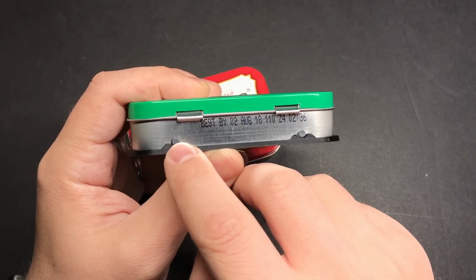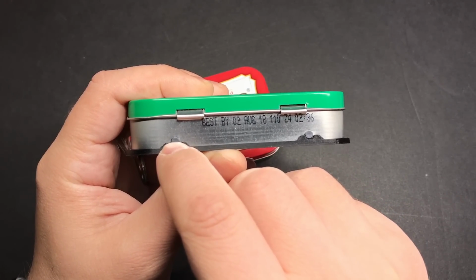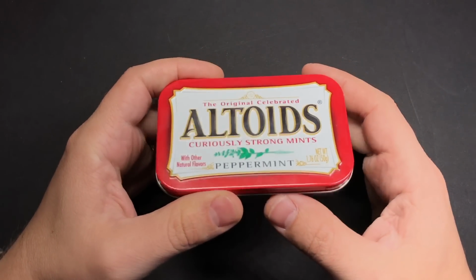Then on the back for the L and R buttons, you can mark right between these 2 peaks, and that's where you need to drill your pilot hole. It's a good idea to put some masking tape across this so that you don't wind up scratching it up.